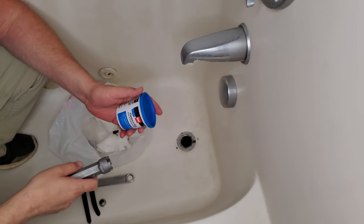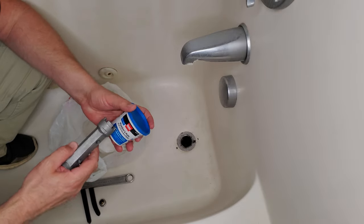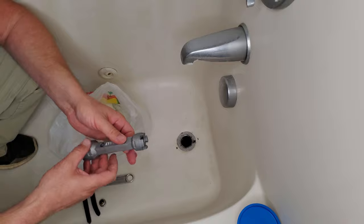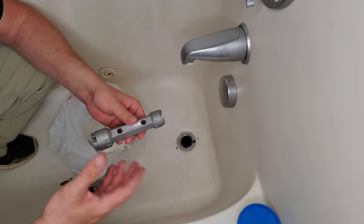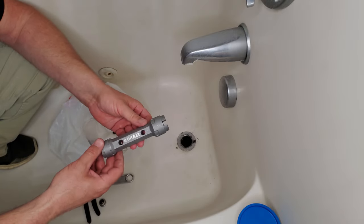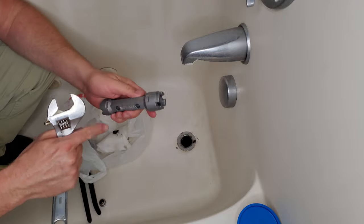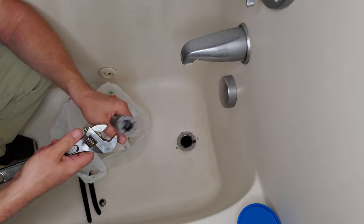The extra supplies we're going to need are some plumber's putty. I always get the stain-free because I use it also for kitchen and granite sinks, but the regular one is fine — unless you have a special tub, then get the stain-free. We've also got a tub basin wrench. I'll have Amazon links in the description below for these items — we are Amazon affiliates. You're also going to need a wrench to turn this with, or you can stick a screwdriver in one of the holes, but the wrench gives more leverage and control.